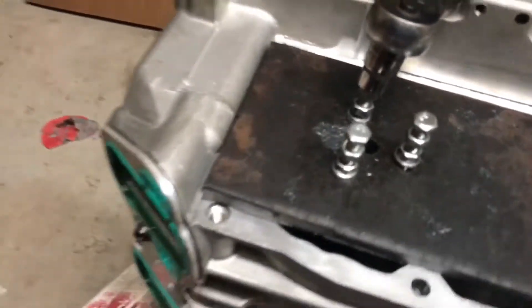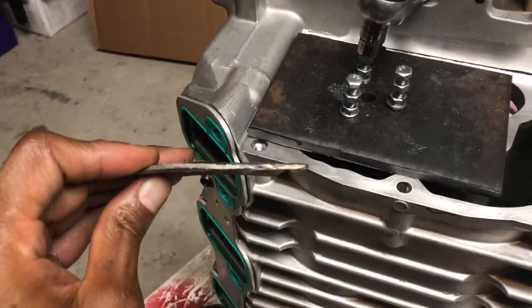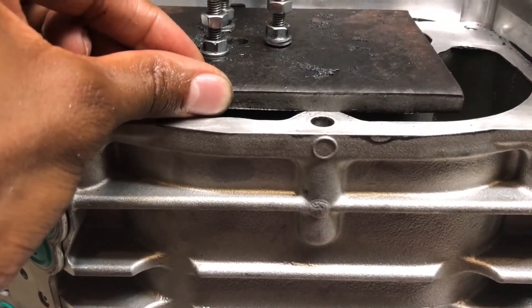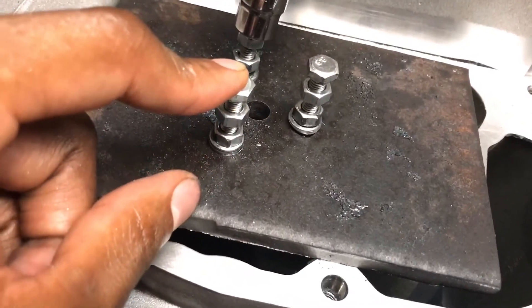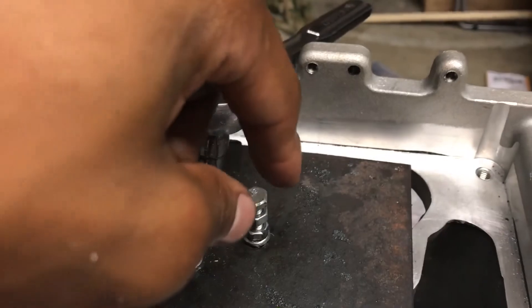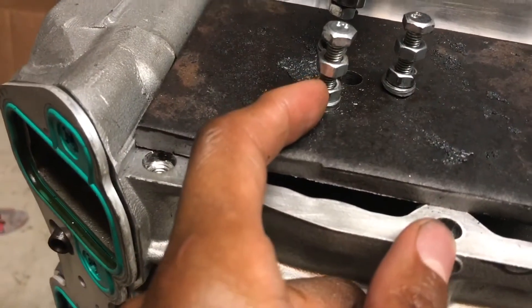This is my little plate — I started with stainless steel, I thought it was going to be strong enough, but I had to upgrade to about a quarter to a third of an inch thick steel. Same idea: drill three holes. I've got M6 bolts, they have to be at least 70 millimeters long, threaded of course. I just threaded those three into the three empty holes in the hub — they have threads in there — then just use some washers and some nuts.